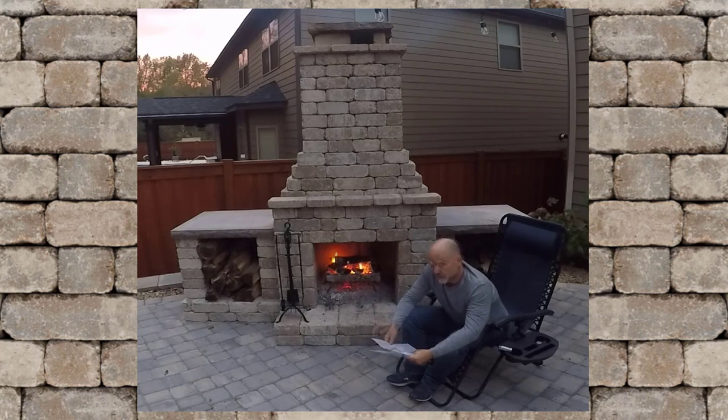What would I do differently? One thing, I would pay more attention throughout the build on each block. Like I said, I was using my 4 foot level and checking the whole side, and I'd pay more attention to each block, level in each way.